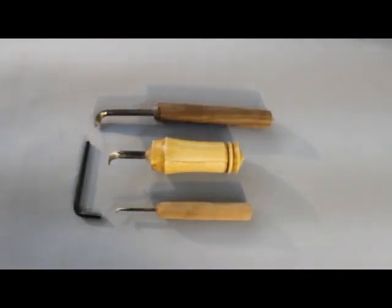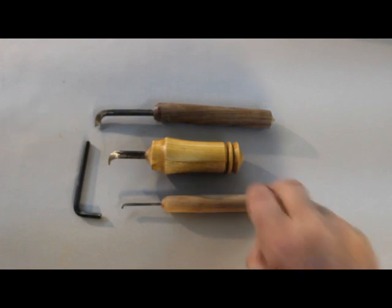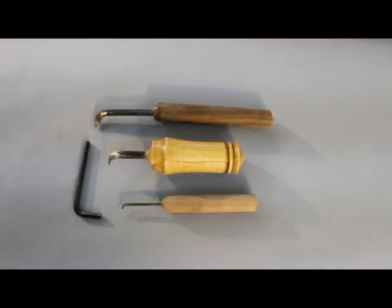Tools made from Allen wrenches can be the easiest and cheapest tools you can make on your own. If you have a grinder or maybe a sanding center, you can grind down the end of the tool to make it a hollowing tool. This is a real small Allen wrench that's very suitable for very tiny items that you might be hollowing. You can make any size you want depending on the Allen wrench, and I use these a lot on Christmas globes to make them hollow.